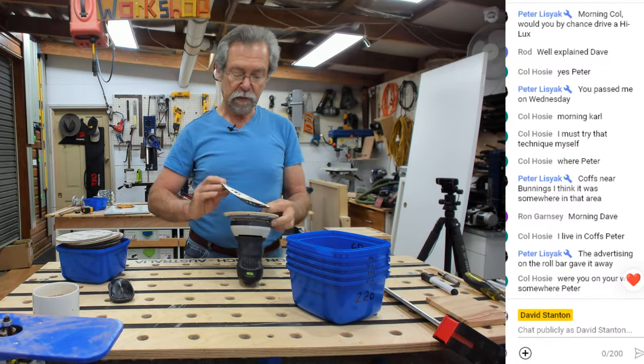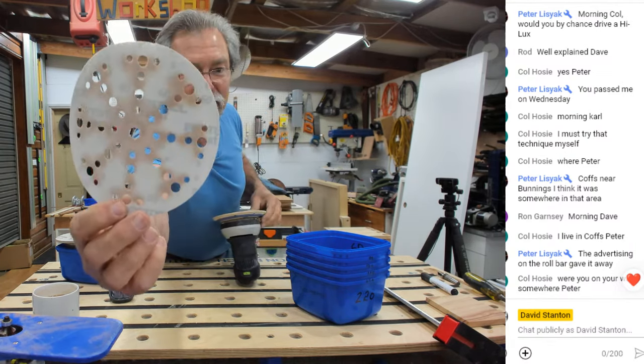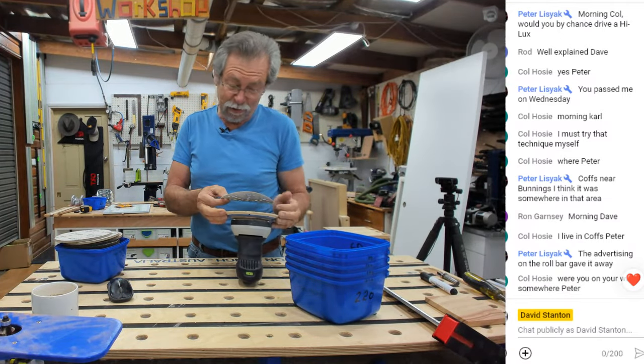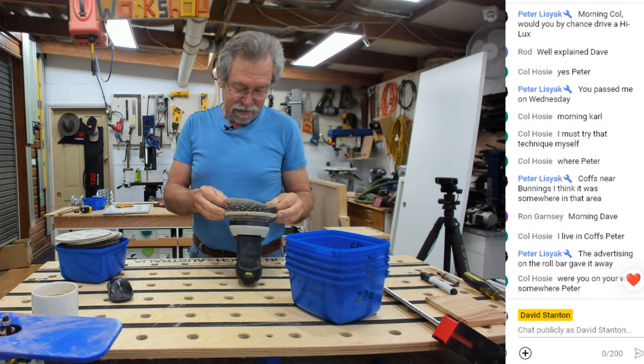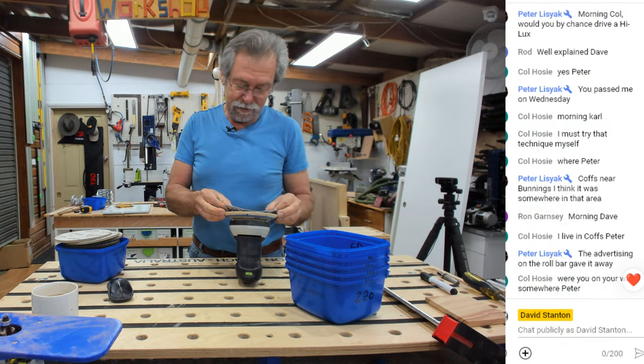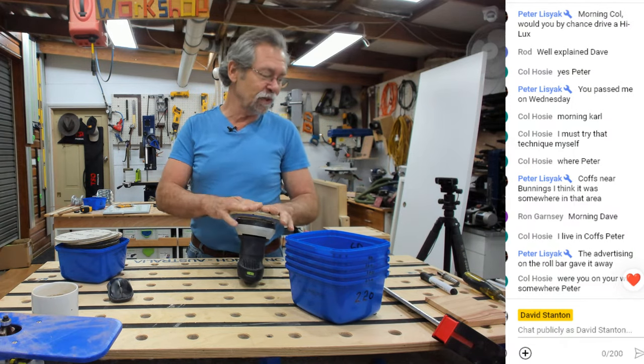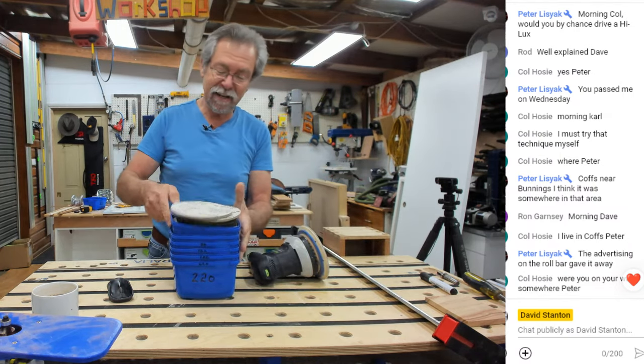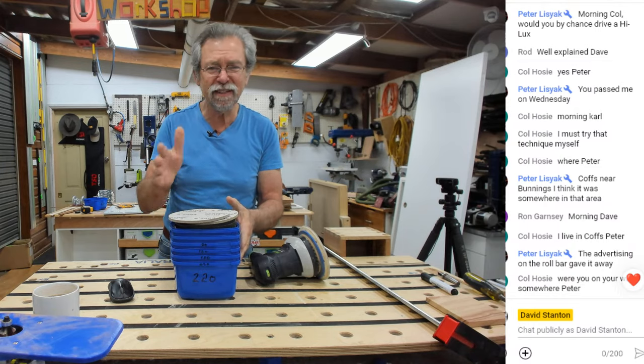This is 60. See, believe it or not, 60 grit paper. I tried 40. Bad move. It's too aggressive. And I keep on going back to it, saying, you know, old hands that watch the show are very kind. Say, so Dave, 60 grit paper. Just use 60 grit paper.